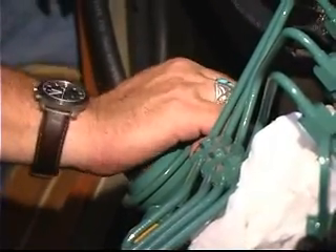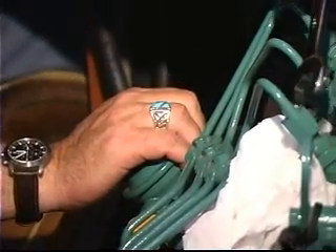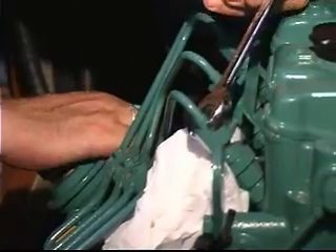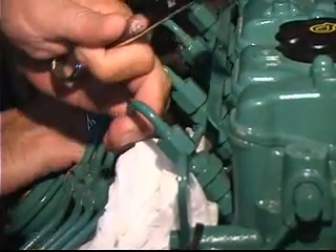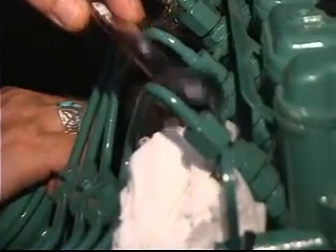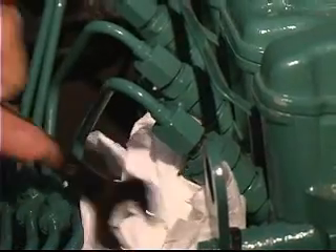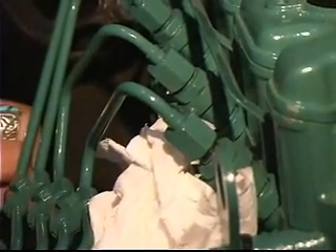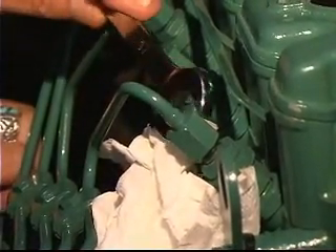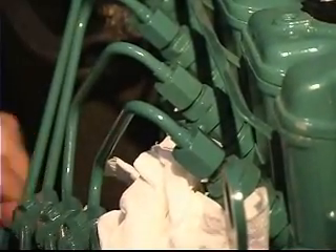What I'm doing now is trying to force some fuel up to the fuel injector. The line is cracked, and I want to continue to pump until I get all of the air exiting out up top and I see a good steady stream of diesel fuel. Then I'm going to close the line and seal it off.